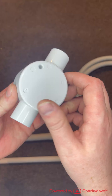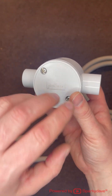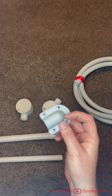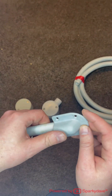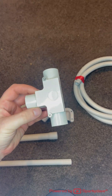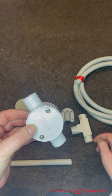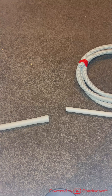Here is a two way through box. You can drill a hole in it, have the cable penetrating through the wall into here, do some joins, and then it can split out either way from the conduit. Another type of penetration is a cobra clamp — these come in different sizes and clip nicely around the conduit. This here is called a three way tee piece or three way inspection box. These boxes can go up to four different ways, so you can have four different conduits coming out 90 degrees from each other.